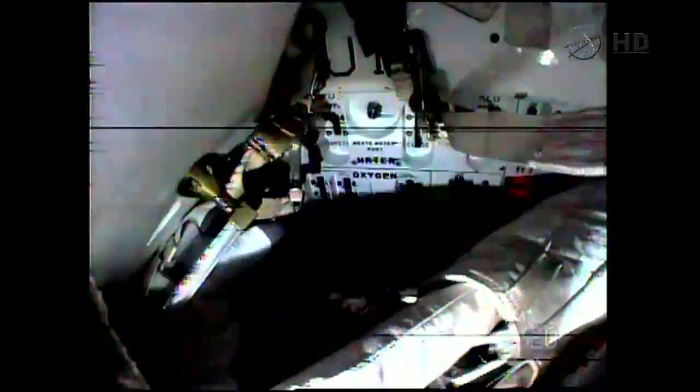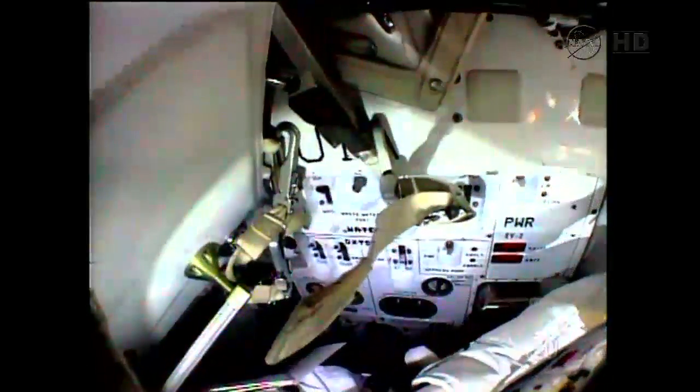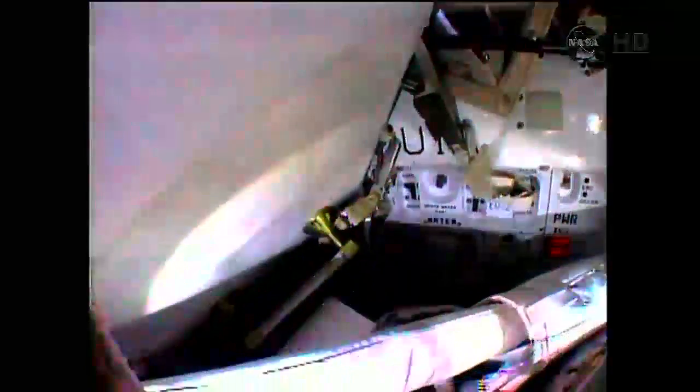Sounds good? If you could just confirm the rest of that chain so that I know, that would be cool. So that safety tether that's coming up from the hatch comes to my right D-ring extender. The small hook is closed and black on black. From there, the load path continues to another small hook closed black on black towards my waist tether, and that's hooked in the airlock D-ring extender, closed black on black.